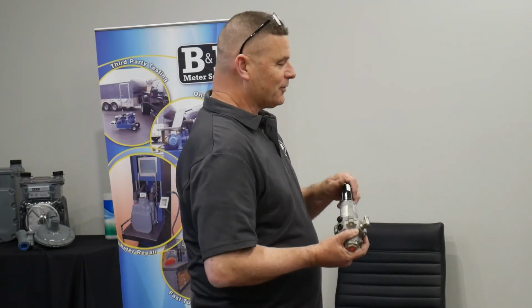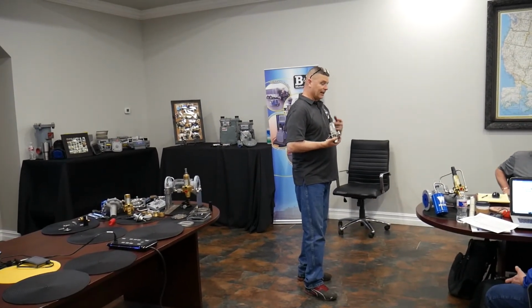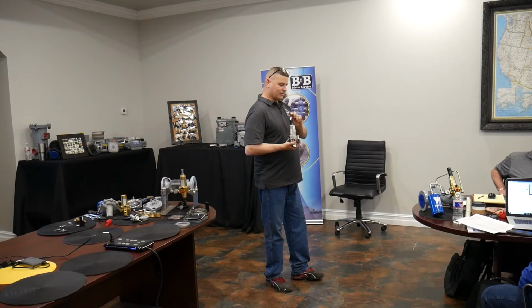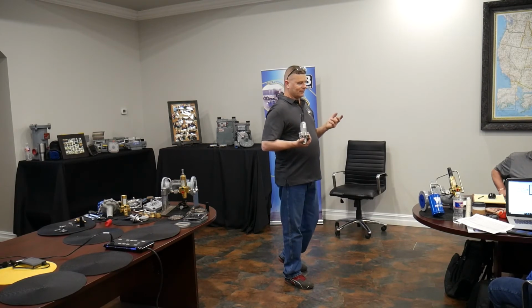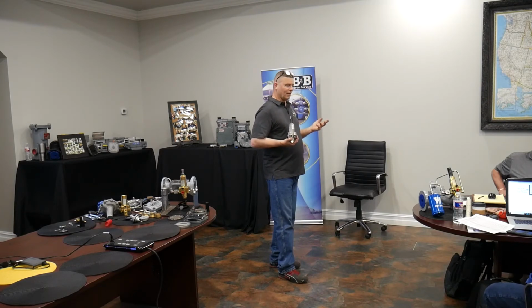We've had situations where, as they use stuff in their system, they had a low pressure system with one of those on. So the contrary is true. If they had a red spring in there that was 3 to 12 pounds and they had that anti-crush, or anti-brake spring in there, call it a dwarven wedding band, do you think they could get 10 to 12 pounds out of that pilot and set it? No way.